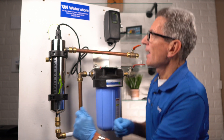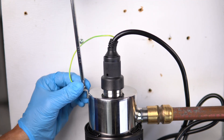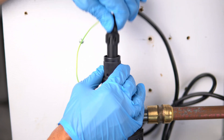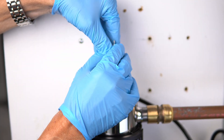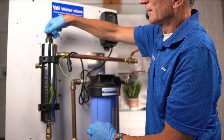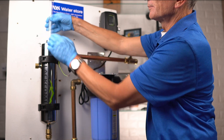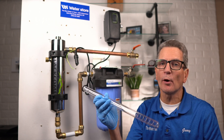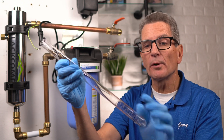Now we're going to be working on replacing the lamp, so this is a good time to get your gloves on. There's a captive ground screw up here, so you're going to unscrew that. That's going to give us access to the connector for the lamp. You'll push down slightly and turn the connector at the top — you'll notice the lamp is on a spring. As the lamp comes free, you grab the lamp and pull the connector straight off the top. Pull out the lamp and then unscrew the gland nut at the top — lefty-loosey. Pull that off and inside you'll see the quartz sleeve. Pull the quartz sleeve out. It's very important that you clean it at this point — it has to become perfectly clean, just like brand new. If you can't get it perfectly clean, you'll have to replace it. Make sure you don't lose the spring in there because it's very important.